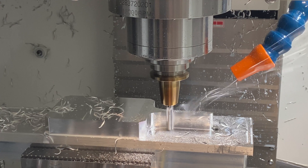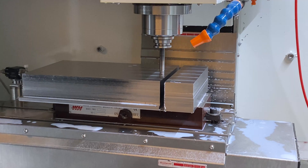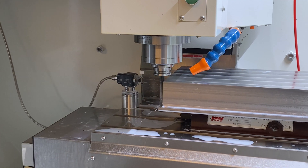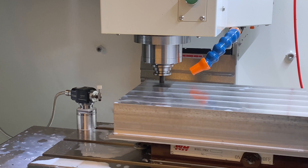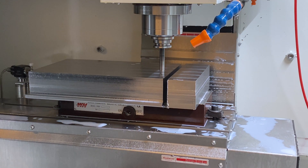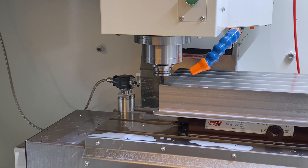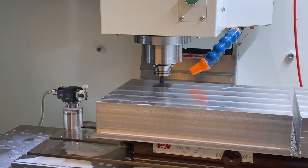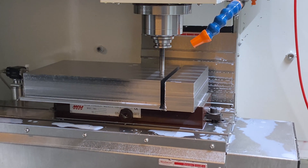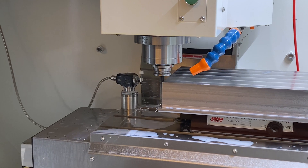You can hear it squeal a little bit as it starts to get thinner. Now we have the feed mill, and we're working in the X7 right up near the travel limits — very close to the limits in both X and Y. You can hear that when it plunges down it's nipping the material, because we're so close to the limits. When it's in the cut it's actually really clean, but right when it enters it nips a little bit. This probably could have been avoided with additional setup or breaking it into more operations, but it worked well — I ended up slotting the right-hand side and broke that off later. The magnetic chuck worked out really well.